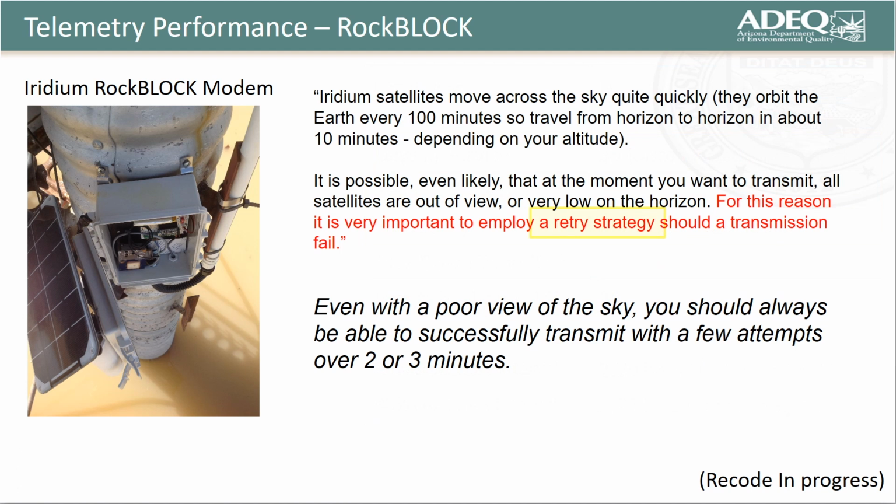After communicating with the vendor, we determined that the cause of the dropped data was lack of error handling in the code that I had developed. Error handling is needed in the event that transmissions from the modem are not completed before satellites drop behind the horizon. We're updating our code to handle these errors when they occur. Once that code is updated, documentation and programming for this upgrade will also be posted.